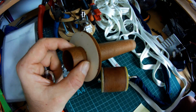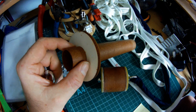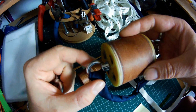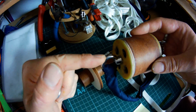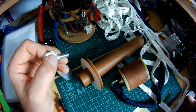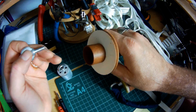So they can be used to create those mounting points, or they can be used to create a sort of baffle that stops the hot gases from the motor ejection charges from damaging components above, but you might not include the recovery mount point on the actual baffle as well. So they can serve two functions, one about safeguarding from fire, and the other to provide a structural point for the recovery.